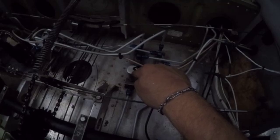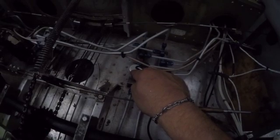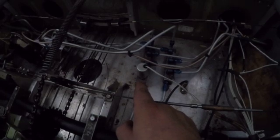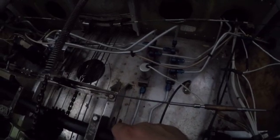This isn't what ended up being our issue, but here's your pressure switch that shuts your pump off — it's sensing pressure. On this model I believe it's about 1,700–1,800 PSI. If this shuts off too early without building enough pressure, it keeps the pump cycling trying to pump the gear up. That wasn't the case here — the pump was putting out plenty of pressure. The gear would come up, cycle off, and then three to four seconds later start sagging again. Left alone, the gear would come completely down in about five minutes.